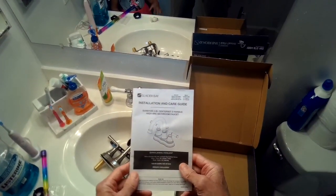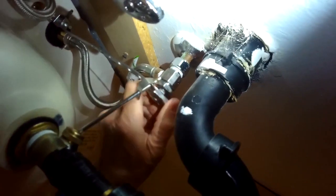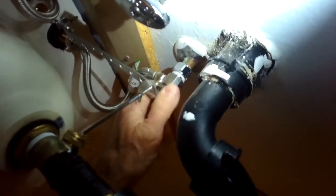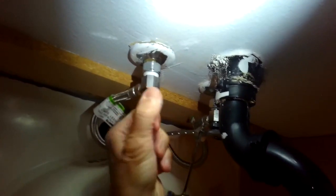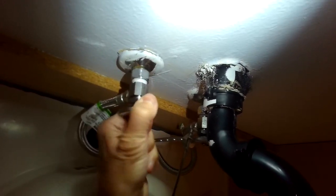You don't need too many tools for this — just a pair of pliers and a little plumber's putty or some caulking. We're turning off both the hot and the cold water here underneath the sink. You want to get these turned pretty hard so they're fully off, because you don't want them to be leaking a little bit as you do the work.